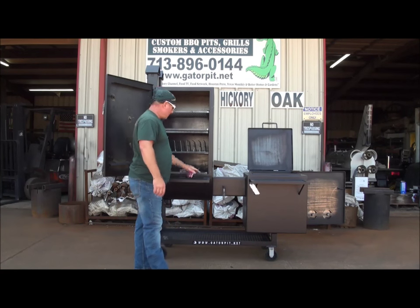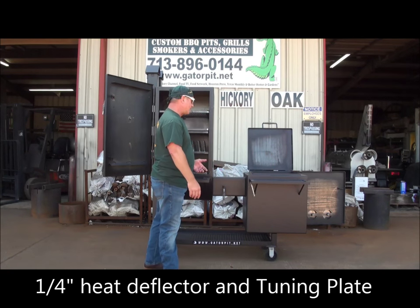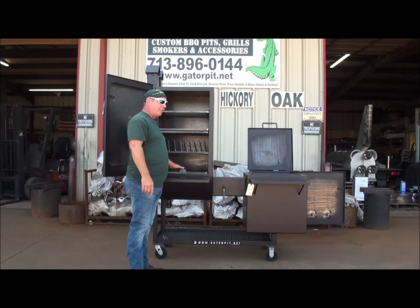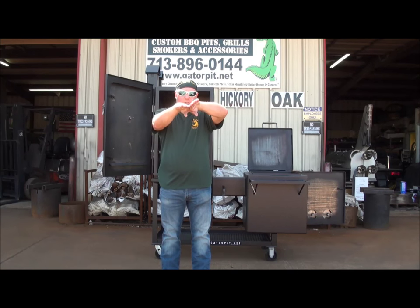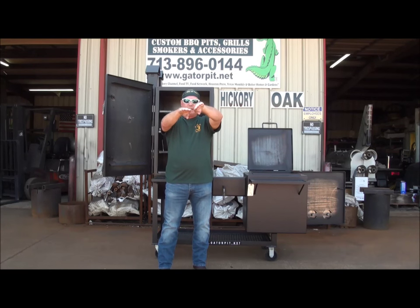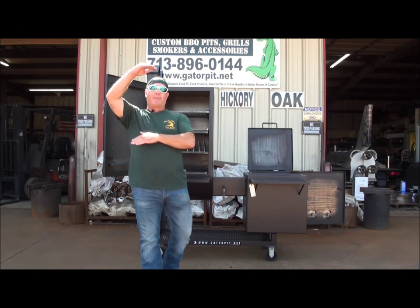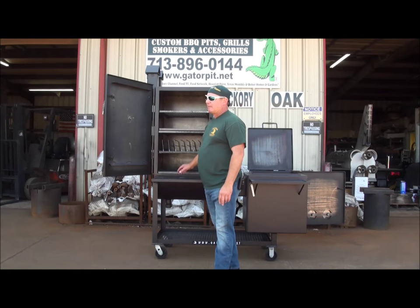There is a tuning plate in here — a quarter inch baffle that's welded. It's a fixed deflector plate that comes in about eight inches, full size, welded on all three sides so no air or heat can come around it and create a hot spot. There's also an adjustable tuning plate that is removable and slides several inches left and right from the deflector plate, spreading the heat out to cut down the hot spot. It also allows the temperatures in the upright to get more even top to bottom. We do everything we can to cut the hot spot down to almost nothing.